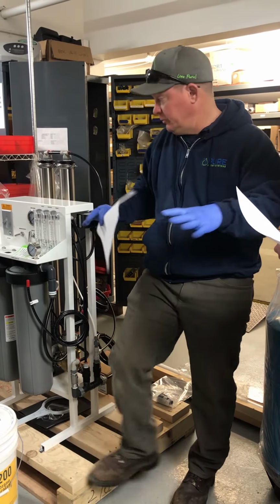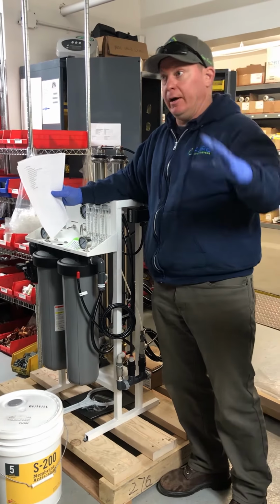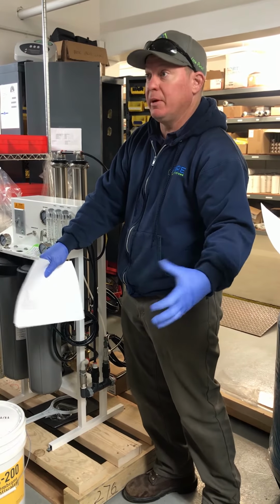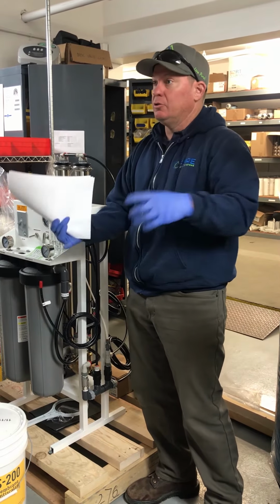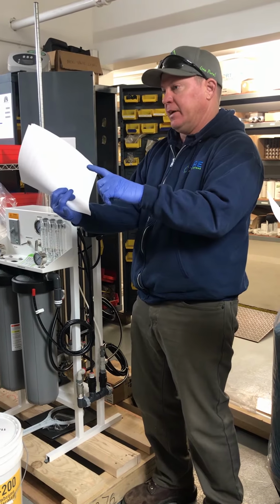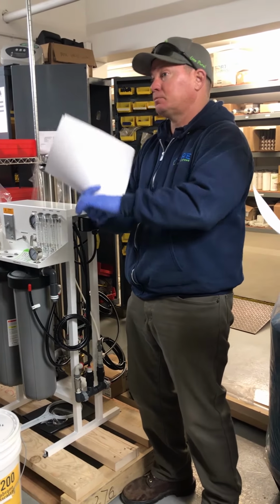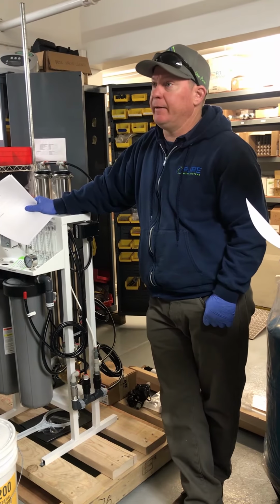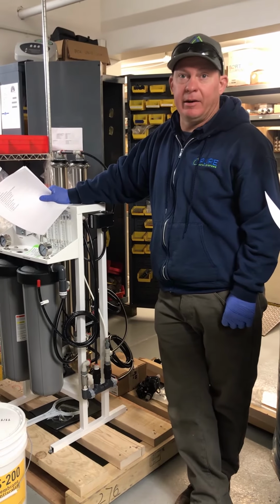Basically, for those of you who don't know, the water from this RO fills up a large holding tank. Then coming out of the holding tank, we use a Grundfos repressurizing pump or booster pump. And that booster pump is actually what's supplying pressure to the house. So after the booster pump, we're putting our post-treatment. That's going to be the pH filter, the ultraviolet light, and the big blue. The sole purpose of the big blue is so that we can disinfect the holding tank, dump some bleach in there, and then that bleach doesn't make it into the house. And it's also a final barrier too.